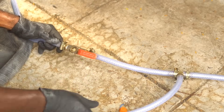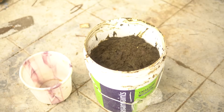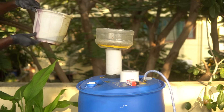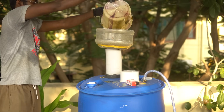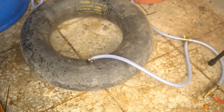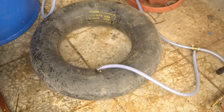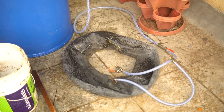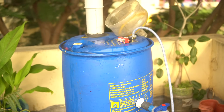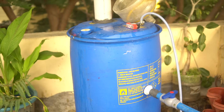I also made an improvised funnel from an old water can — it's important to have a cap to close the pipe after adding waste. To fill the digester, I open the valve going to the rubber tube and close the other end. I got a bucket of cow dung from a nearby cattle farm, made it into slurry, and poured it in. Cow dung slurry is only needed the first time; after that you feed kitchen waste. The tube filling with air confirms there's no leak in the system.